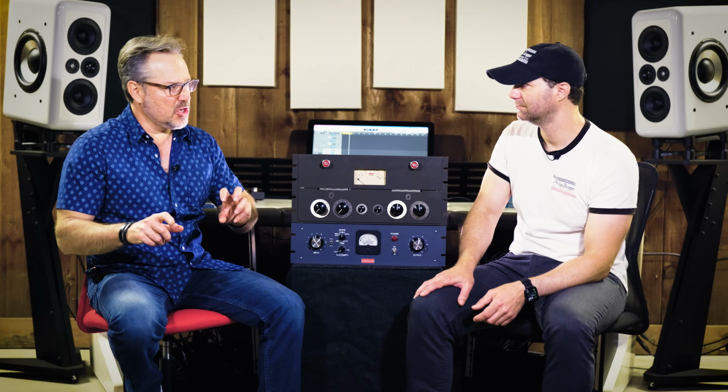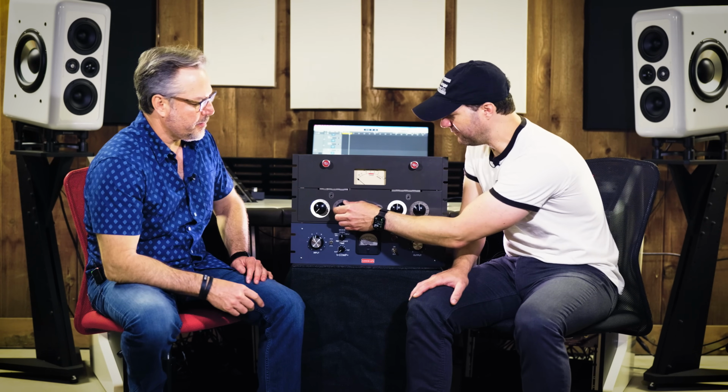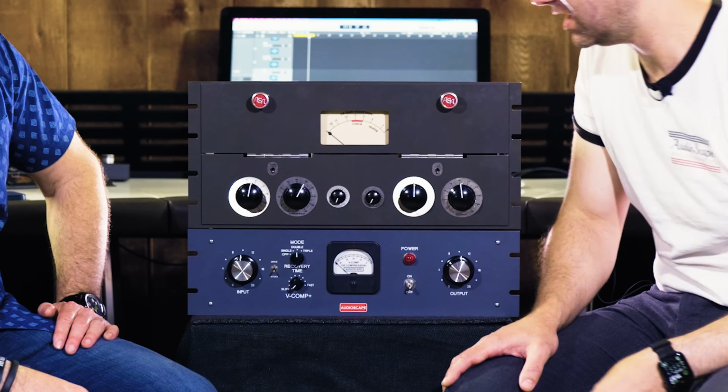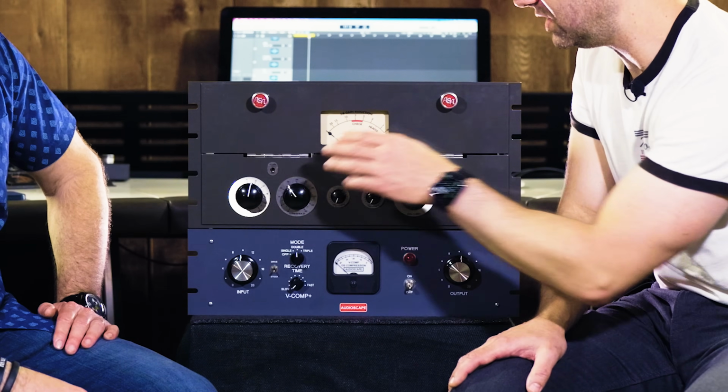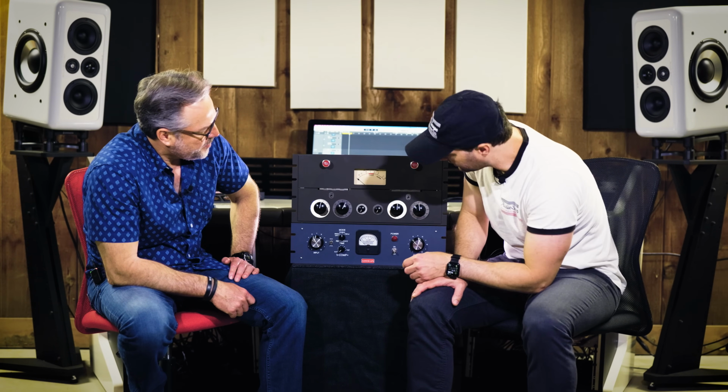If you have a gain knob as well as an output trim, it can affect how much harmonic content you're driving through it. So this simply affects the grabbiness on the input side of the circuit. Gotcha. So, as you start cranking this up, you find, oh man, I'm just hitting it too hard. You can duck this down and it's going to be less grabby on the input side. So, all right. So it's more of a compression. Yeah. Think about almost like a pad on the input. You're just ducking down the signal here on the device itself instead of doing it from your send into it. Understood. That would be a good way to think about that.